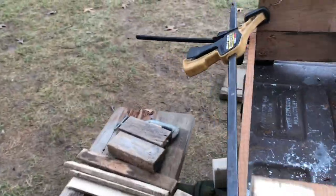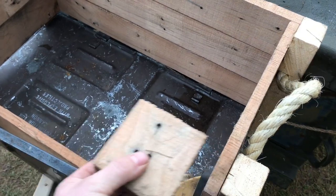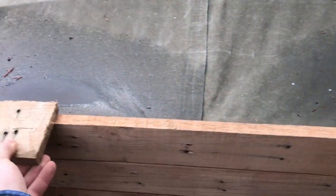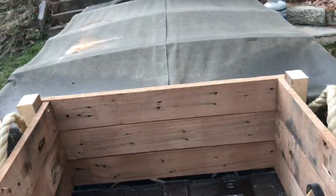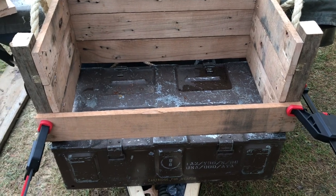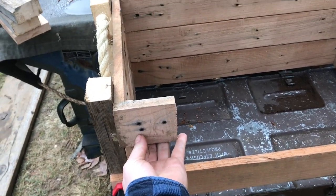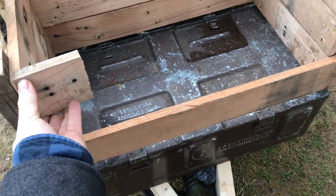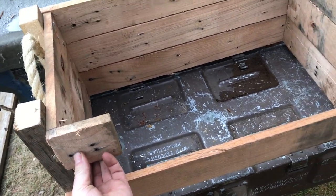I pre-drilled through the hardwood and ran the nails into the pine. I'll have to tear another pallet apart for the top and bottom. The sides had bowed in a little so I used a spreader, but one slat ended up sticking up a quarter inch past the top of the box. I scribed a line on both sides and I'll take a hand plane down to the line, then put the smooth side on the bottom so the rough side faces up — it'll look legit.